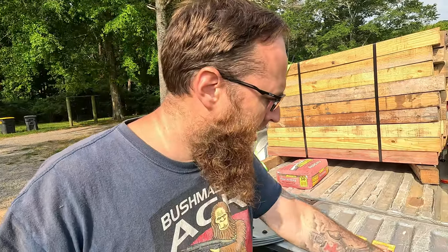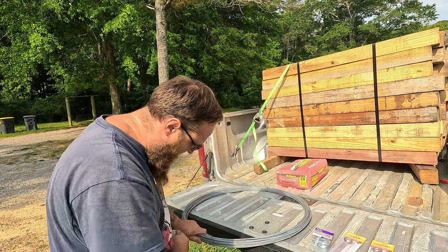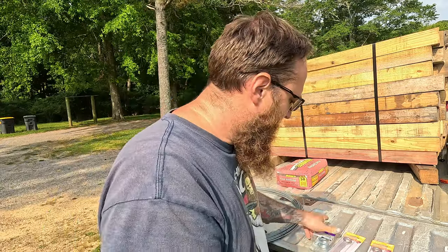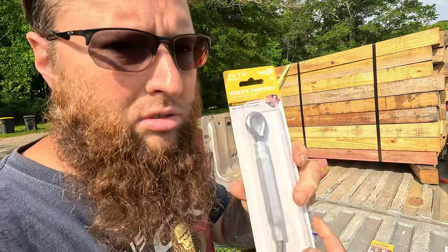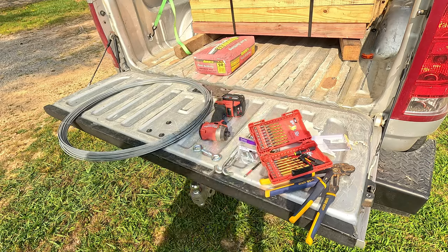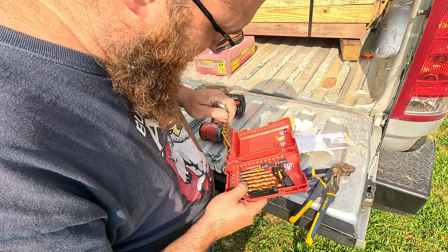It's been a little bit. You'll need a few things for the next step — a decent pair of cutters depending on the gauge wire you're running. It's a 170-foot roll of nine-gauge tension wire. I got some eyelets that should be plenty stout and turnbuckles. This end I'm going to run the wire through, and this end with a hook I can hook onto the latch. For ease I might grab my drill to pre-drill a tiny hole and get these started — normally you can just hit them with a hammer, push and turn. I have an impact driver — I just need to find the right bit.